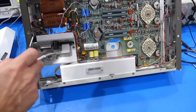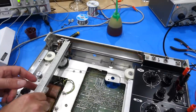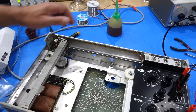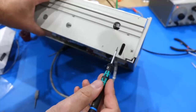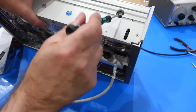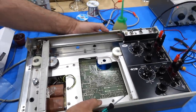And then you adjust the tension similarly by rotating the motor. That's the one where you get it to 25 ounces. So that got me to where it started to move smoothly without making noise. I basically adjusted it for minimum noise. And this guy was still rattling a bit. And the way to adjust it is to move it all the way to the back. And here is quite hidden. There is a slot. And if you put your screwdriver in the slot, you can access a screw right here, which varies the tension between the carrier and the rod. And that was way too loose, so that was causing it to vibrate. And then once you get all of that, the X-axis started to be really smooth.